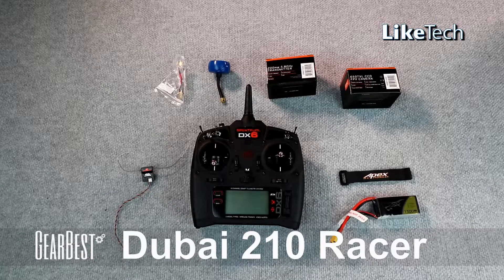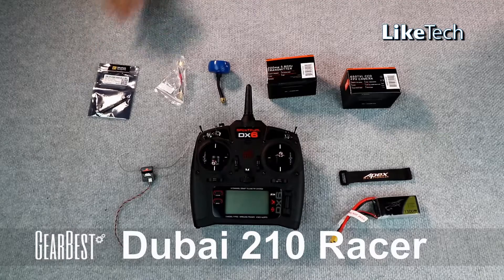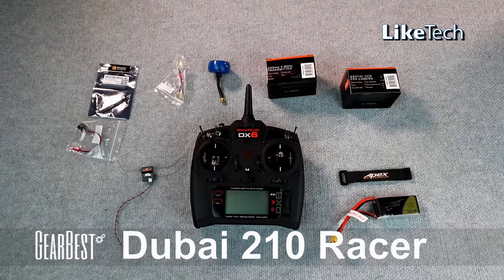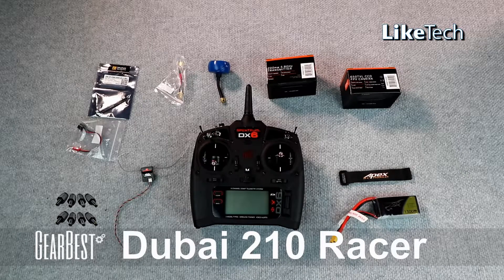Optional things include lights to put on the back for orientation if you're new and perhaps don't have FPV goggles, and a buzzer to announce your drone when it gets lost. Critically missing from the kit are standoffs — you need eight of them. Nylon is best to secure the power supply board and the flight controller board to the drone. With these things you're on your way to building your drone.